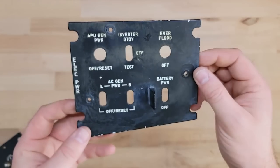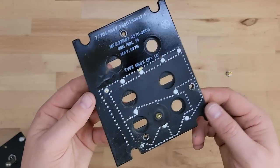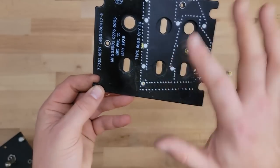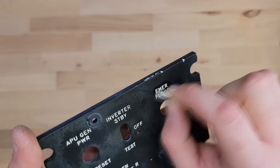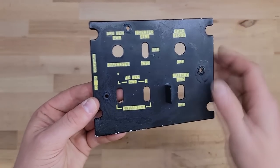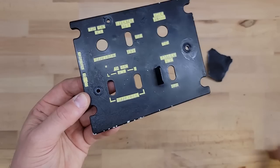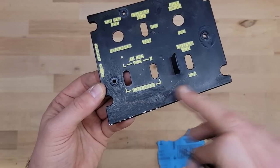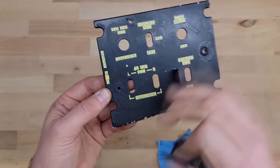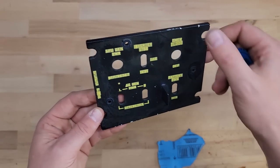Now I'll work on this plate — clean it up as best I can. I'm just going to get in there with some Q-tips and clean out all the dirt. This bit is flaking so I'll hit it with an air duster and refrain from wetting it. I've masked up the text so the paint won't hit any of that — it'll also protect it when I give it a very light sand with about 600 grit and 1000 grit. I'm not trying to get all the paint off — just trying to even out all these bumps from where it's been touched up in the past.